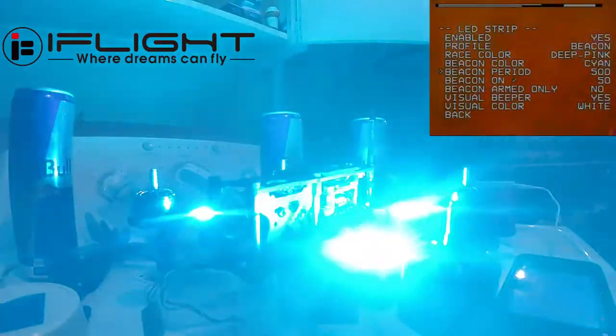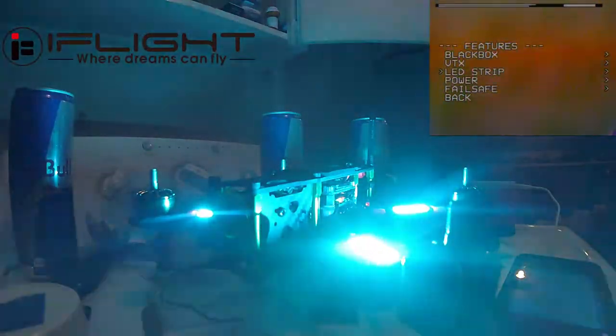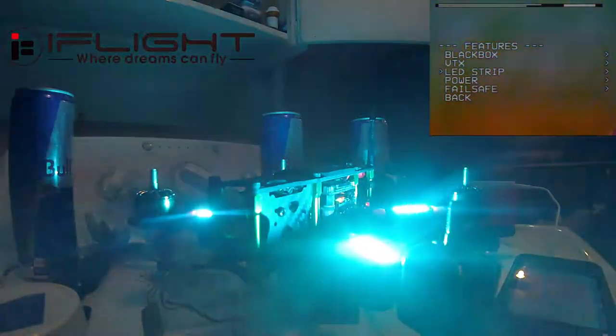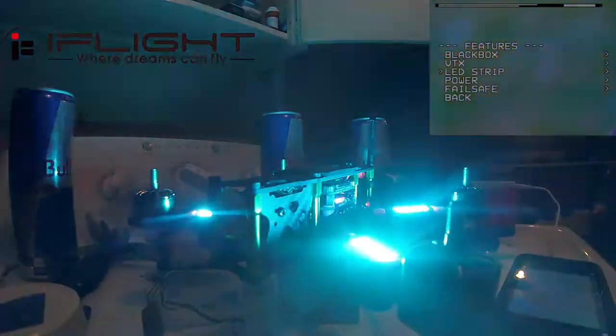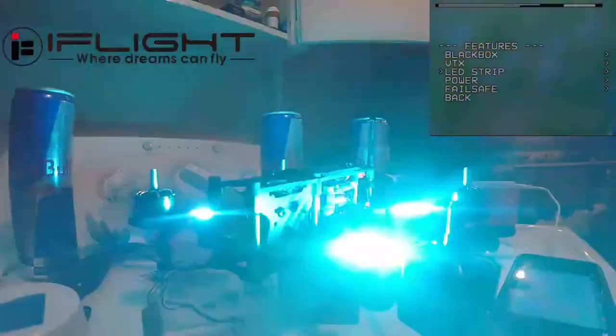You can knock this number down — let's go all the way down to 50. That's as low as it'll go. See how fast that is? The camera only captures snapshots so it depends on whether it flashes within the snapshot — I'm doing 60 frames per second and this is 50 blinks per second, so it'll be off a little on video. Let's bump it up to 150 — go back, see how that slows it down.